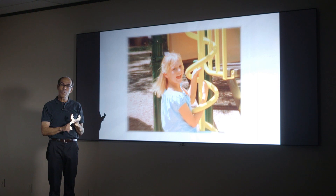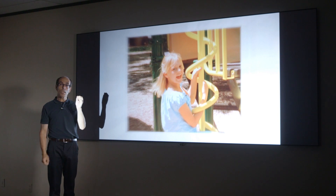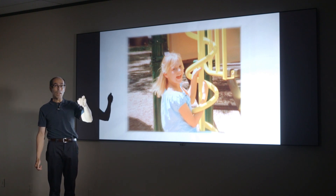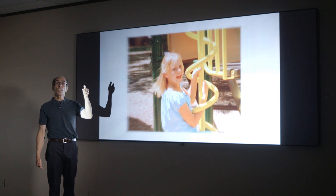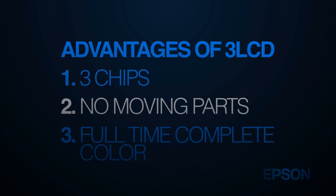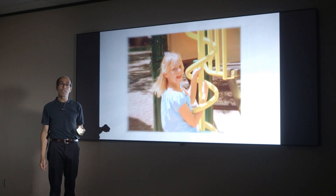The inherent advantages of three LCD projection: time-tested technology using LCD technology; three chips, always one for each color. In single chip display devices, the single chip has to do one color at a time — it's called sequential color flashing. The colors are flashed at you — red, green, blue, red, green, blue — quickly and sequentially, so fast that your brain has to be fooled into thinking it's a full color image. Three chips, no moving mechanical parts in the light engine, and full-time color, which is a natural byproduct of three LCD technology.